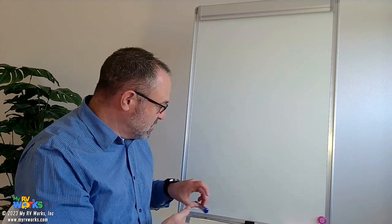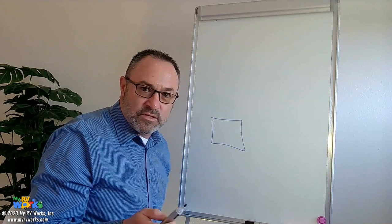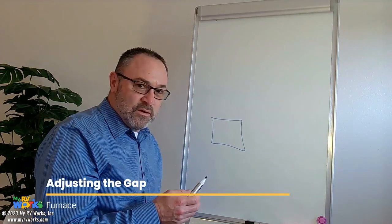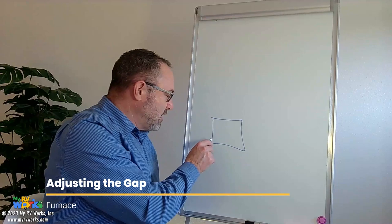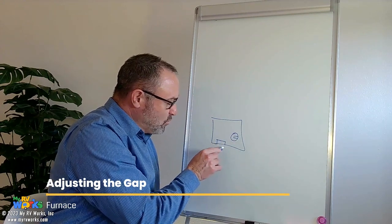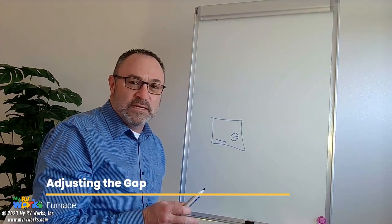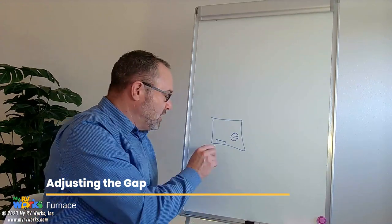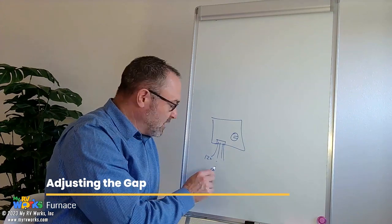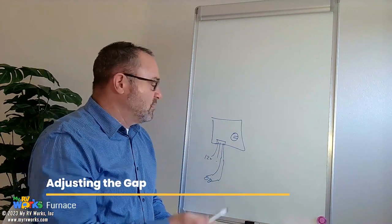So here I am — I'm a control board. We'll start with a furnace, then we'll talk about water heaters, and then we'll talk about refrigerators. Your furnace is going to have a control board, and the control board is going to be the brain of the operations. This is where your wires connect. You've heard me talk about a furnace being on an island in the middle of nowhere, but it needs four wires to connect to the rest of the world. These two wires are 12 volts plus, this is 12 volts minus, and these two wires go out into the world and connect to something — that's where it's called for heat.